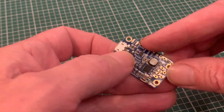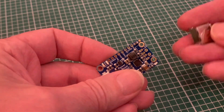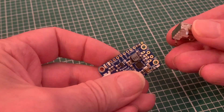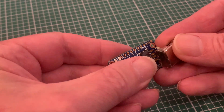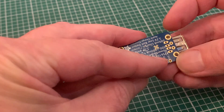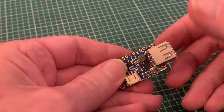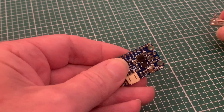The inputs are simple enough, but we've got a couple of options for the output to power the Pi, both requiring some soldering. One is to use the USB socket supplied with the charger and a short standard cable to the usual input on the Raspberry Pi. For that we just need to solder these pins on the back, but that's still going to be quite bulky, so what I really want is a more compact solution.